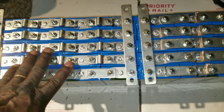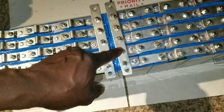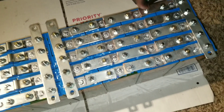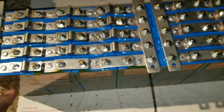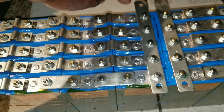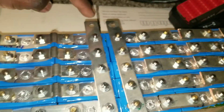I'm going to tie this entire bank into a 12 volt system. Here is a 12 volt, and here is a 12 volt. I'll end up doing the BMS here on the positive leads, with positive and positive on the leads right there. That gets tied up for the 4S configuration. On the BMS the negatives — I can do the same time. I can put a string on the positive going to the negative. You know how you wire the BMS. We can tie this battery here, positive to positive, negative to negative, so it becomes one giant battery. We can use one BMS to do the job.